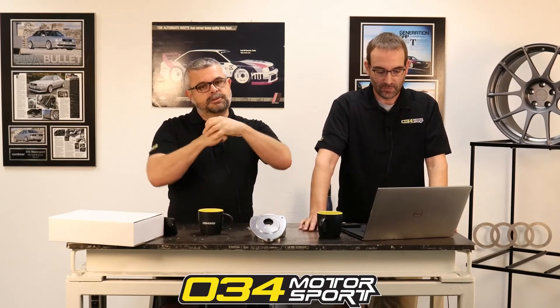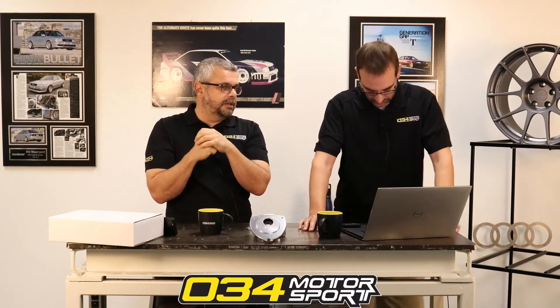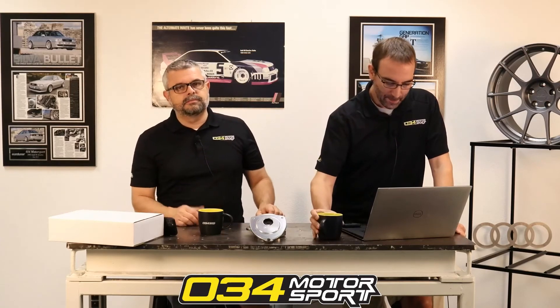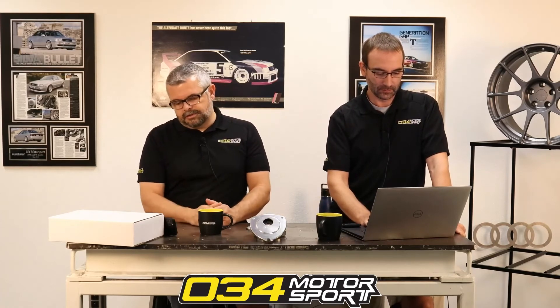The joint is already lubricated with Teflon. There are other kinds of ball joints with a metal socket where grease is the lubricant — metal-on-metal or metal on bronze. Because of the Teflon lining we use, which is a much more expensive bearing, you don't need any of that. It seems like a good idea, but it's not required.